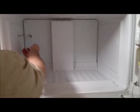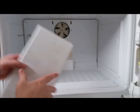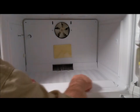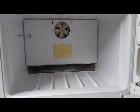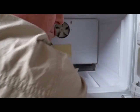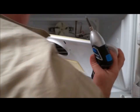To explain how to take it apart: the ice maker is up here — you take out these two screws, slide out the ice maker, and unplug it. There are two screws here, pop this up, slide this out, piece of foam — jimmy it gently up in this particular model and it comes out no problem. Then take the bottom out with two screws, lift it up. After that you've got four screws holding the back panel in place. Make sure you keep track of the screws, otherwise they'll fall and you'll waste an hour trying to find them. Pull out this panel.